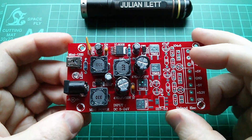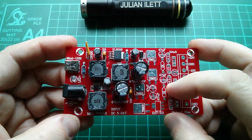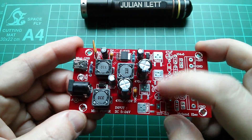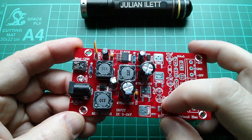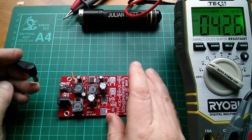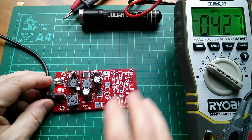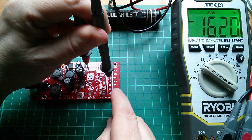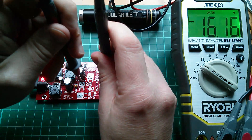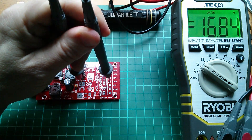I've fitted all the remaining components — the electrolytic capacitors and this rather tall polyfuse — and what I'm going to do now is power this thing up. I'll just put my solar 12 volts, which is 12.9 at the moment, into the input and then measure on the output what I'm getting in terms of positive and negative voltages from the switch mode part of the circuit. I've got 12 volts coming in from my solar system. We've got a red LED. On the positive side of the circuit we have plus 16.2 volts. And on the negative side — which is actually the tab on this one — we have minus 16.8 volts. So that appears to be working.